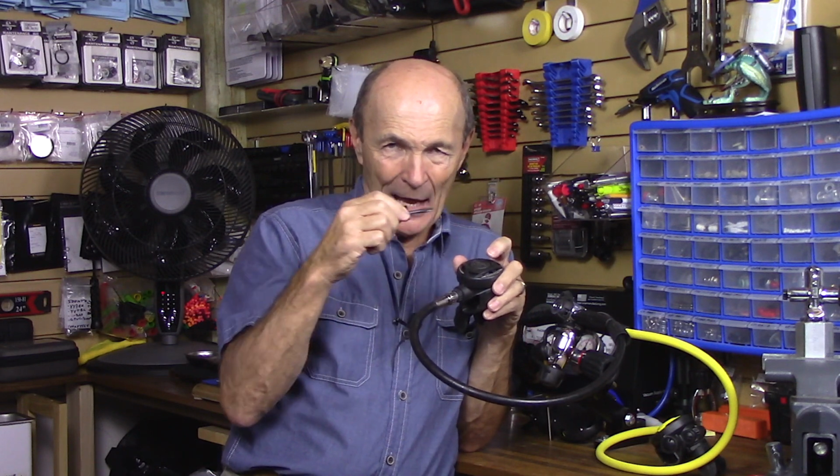So you see the process? You turn it out until it free flows, you turn it in until it stops, and back and forth until you get it right on the edge. And it can be done with a screwdriver. If that's what you have, that's what you have. It'll work. And when you're all done, snug it back up.